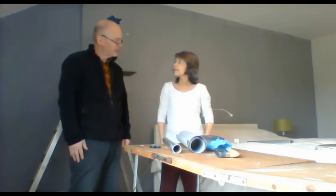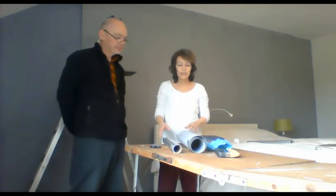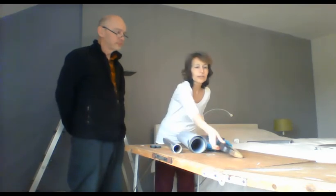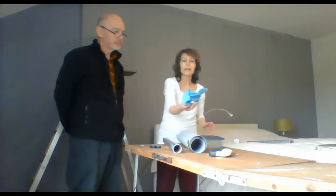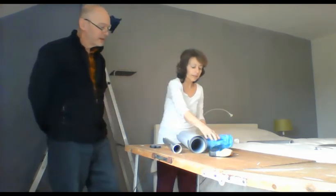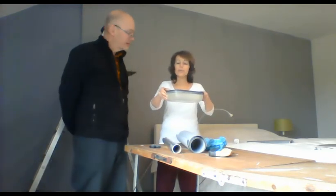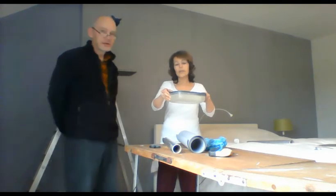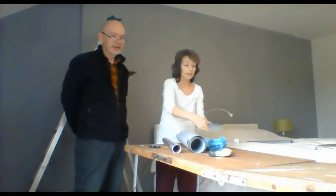Would we like to go through the list of what we've got? It's really very simple. You don't need much. You need a brush to apply the adhesive or the paste, and any rag or cloth to smooth the paper down. Then we've got the paste in here, left over from last week. Rather than throwing it away, we saved it, and it's okay in a Tupperware. We'd like to take credit for making that in advance, but it's actually a complete accident.